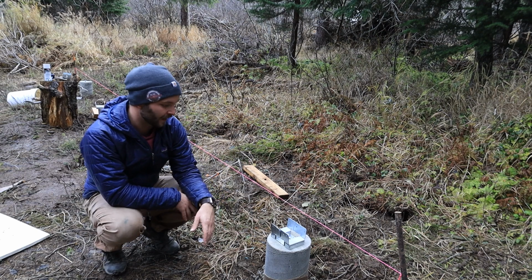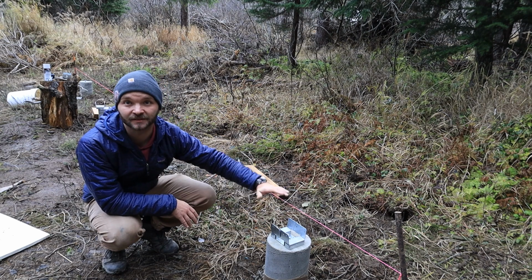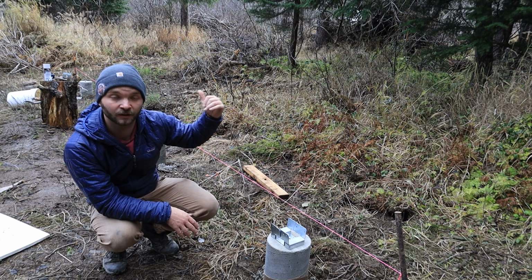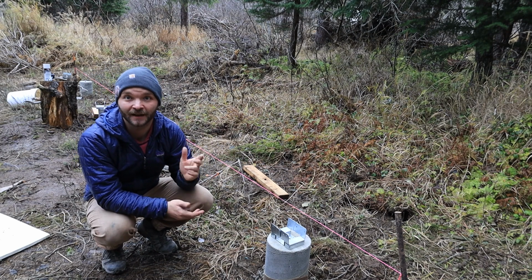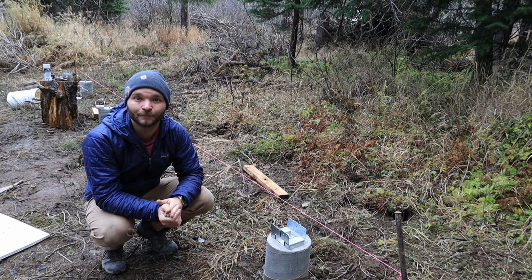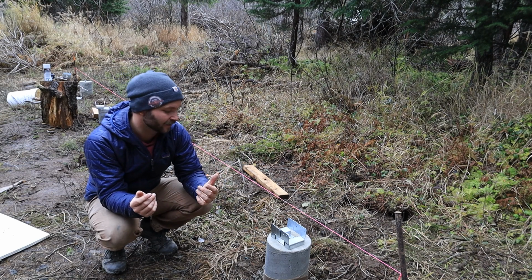And then on top of that, start leveling our piers evenly with each other by using 4x6s to raise where needed. I think the back right corner is the highest, so I'm just gonna leave that one as my level and then build off of that. Gonna be interesting footage. I'm gonna be using the tripod with a laser level I just bought. So it'll probably just be on a stump, maybe more handheld. We'll go from there.